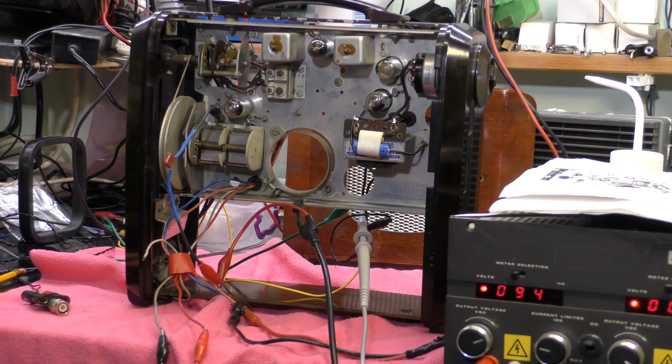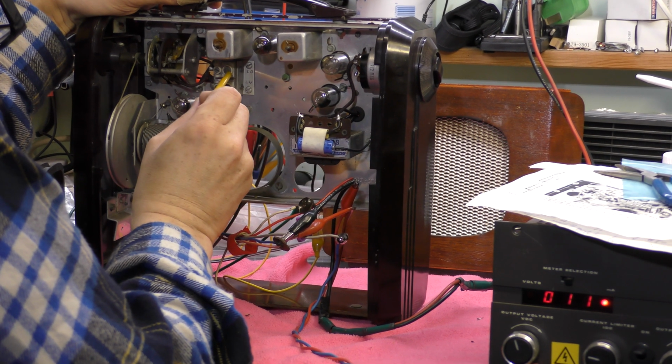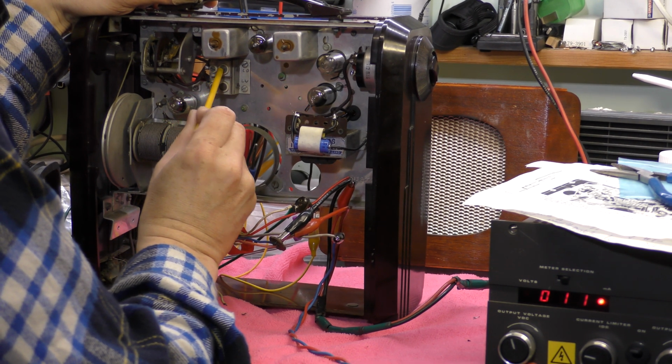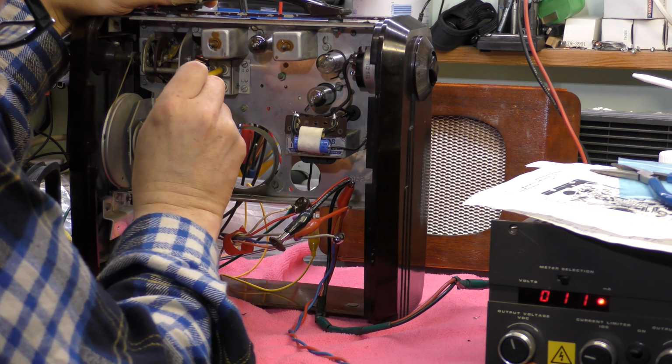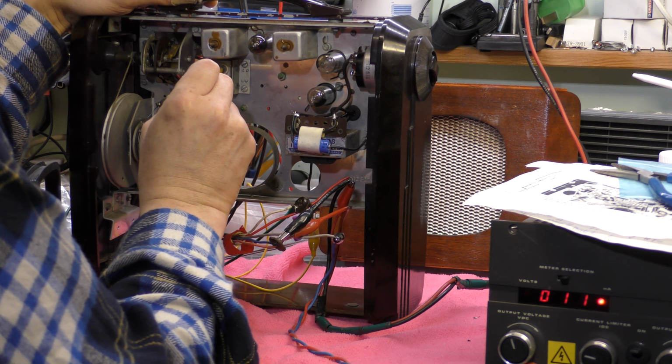A surprisingly large signal is needed when you're injecting into the capacitor. I'm just going to use the scope to look at the speaker terminals and then twiddle up the IF that way. Rather conveniently, there is a little mark on the scale for setting the local oscillator, because I thought, where do you find 206 metres on here? Because the scale's quite broad.